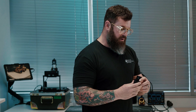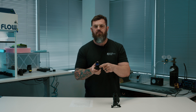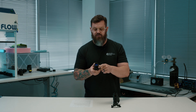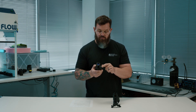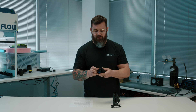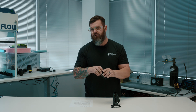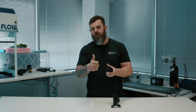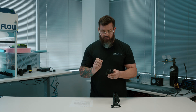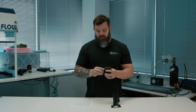This housing does have an onboard IR illuminator, actuated with this push button right here. It's got an auditory click to let you know that you've engaged it. It also has aluminum gating around it so you don't have inadvertent negligent discharges of your IR illuminator. Inside the device, you have a low battery indicator light pipe that tells you both whether your IR illuminator is on as well as if your battery is starting to die. Some other monocular options on the market forgo this feature, but it is nice to have.